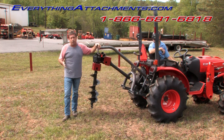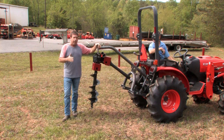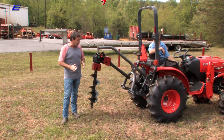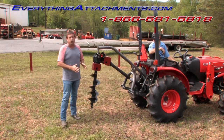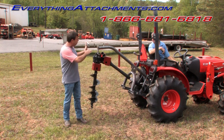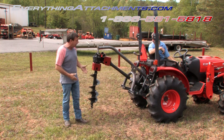We've been selling our junior model for these tractors and it does work, but now I can see where some people have had some slight complications because these tractors are fairly small — small category one compact and subcompacts. The lift gets so small, your working area is small, and because of the size of the tractor you need a shorter boom to be able to lift it out of the ground so when the corkscrew hits it doesn't pull you in.